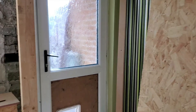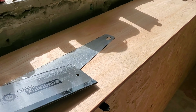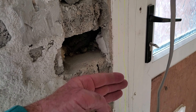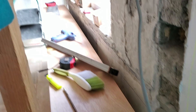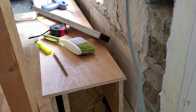So I'll move this wall a wee bit now to allow for these pipes. I have to put this end on — now I know where the wall is going. I'll probably box in this part of the wall here, but this part of the wall is going to be left open — that's going to get plastered today. I'll box in this side and leave this side open, because I'm going to run electrical wires down here and I need access to the pipe and all the plumbing.